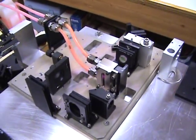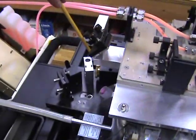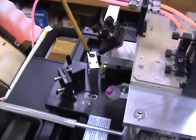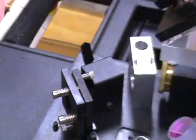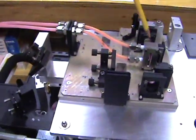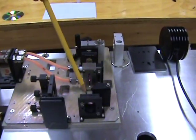The layout of the pump laser is pretty straightforward. The output beam exits the laser, passes through some correction optics, is folded up onto the upper plate where it is focused, folded again, and then brought to a spot within the cavity of the laser.